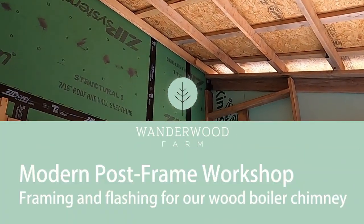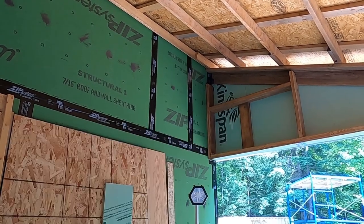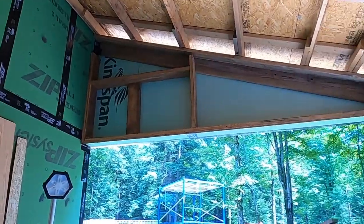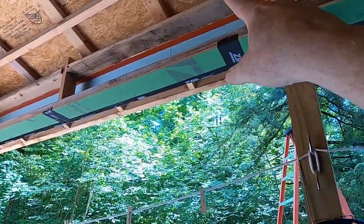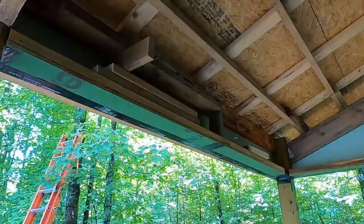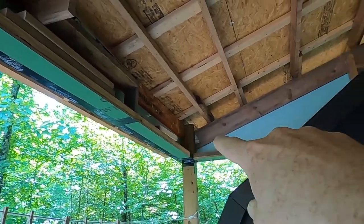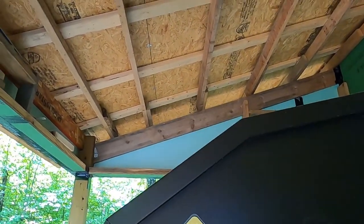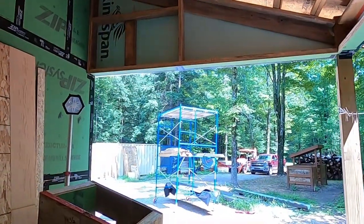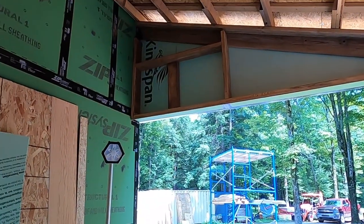Robert and I have been working on the porch walls and roof. Although the porch was framed, we still had to do blocking in order to support the walls — putting a piece there, putting pieces along the top here just to picture frame that wall. Robert's been moving all the way across; he's in the middle of doing this one. Half of it's done, and he'll do the piece that goes all the way up the rake. With that, our wall will pretty much be framed up so we can bring some Tyvek out here and seal it up.